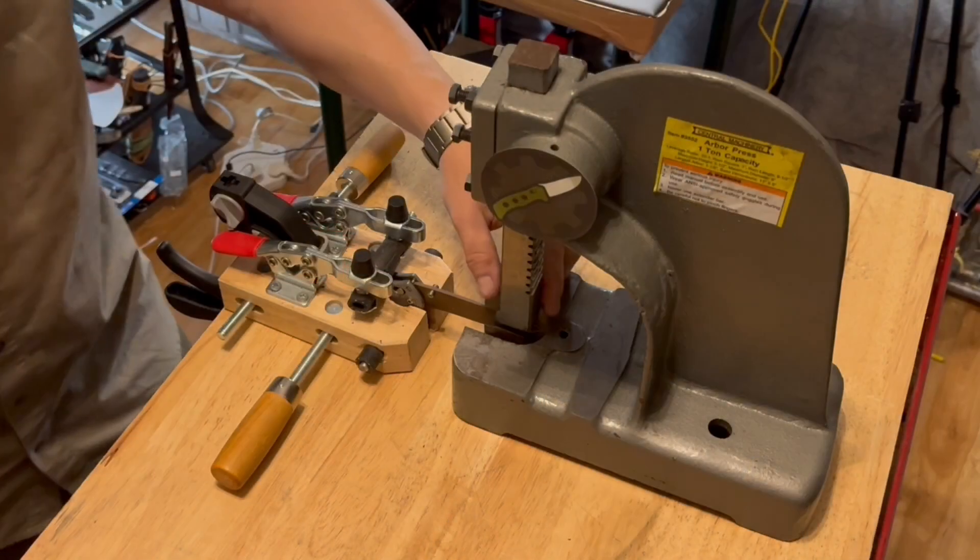Next, let's find out how sharp the Benchmade 710 came in 2011. Here's the secondary bevel — right away I see evidence of stropping; it's almost like a convexity right at the apex, almost like a tertiary bevel. And let's check the symmetry — I don't need to measure anything; clearly it's asymmetrical by quite a bit. And the tip — no comment necessary. Perhaps it cuts better than the new one. Nope — it's not even trying to get in.